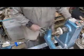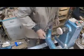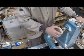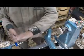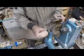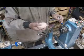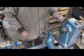And that looks about right. So I put a burn ring on here because this diameter is almost a perfect circle for the Stronghold jaws. And with the Stronghold jaws I'll be able to grab it there without marking the wood. Finish the bottom. That's the base. I'll do a little bit of sanding on this a little later, but just want to get the parts made first. This is my prototype for this miniature yarn caddy, so I'm not going to worry about sanding it until I get all of the parts finished and make sure the process works.